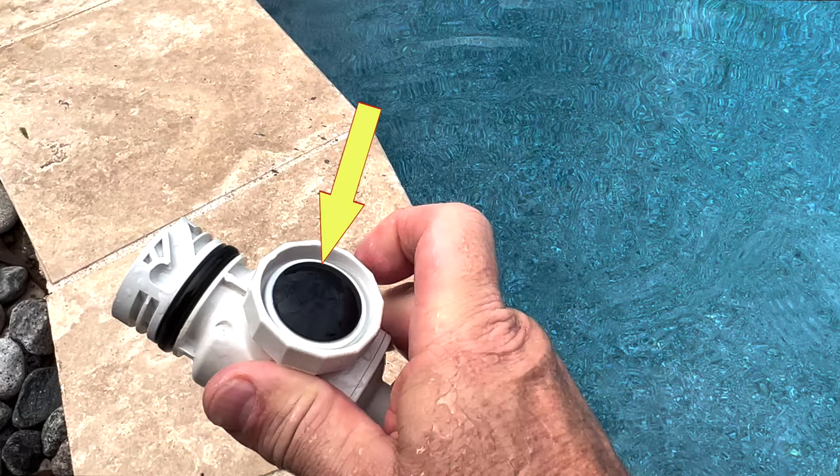This is the pressure release valve — it is spring-loaded and will release excess pressure. You may also loosen it to manually adjust pressure to the cleaner. It is normal to have some pressure being released from this valve. Notice the groove in the quick disconnect — inside of the universal wall fitting in the wall, there are two knobbies. These knobbies slide into these grooves and lock in the quick disconnect. If these knobbies break off, the universal wall fitting must be replaced.